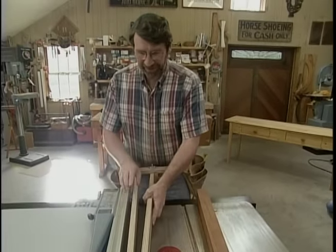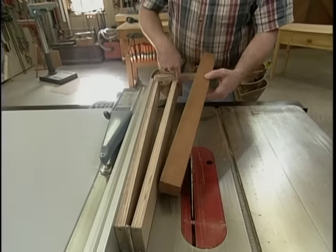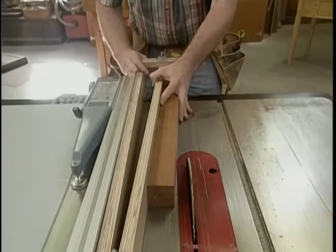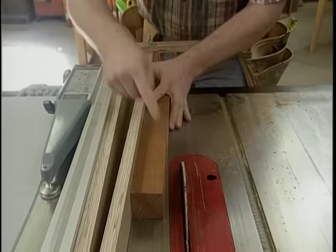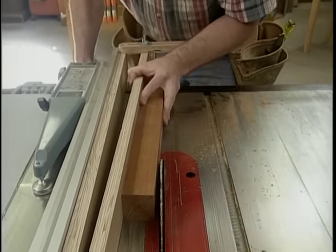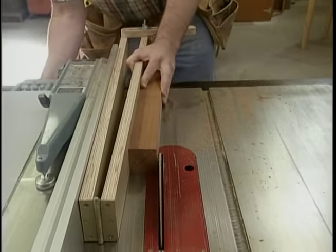Here I'm applying a stop to one end of the jig. Let's give it a try. The jig goes up against the rip fence. A piece of square stock, which might be a leg, goes up against the stop. First thing I do is set the bevel that I want — in this case I'll just do it by eye, about that amount. Now the first part of the leg I'm going to want square, where it might meet a rail. So we'll leave that part way up, slide the whole assembly over, back it away, and make a pass.